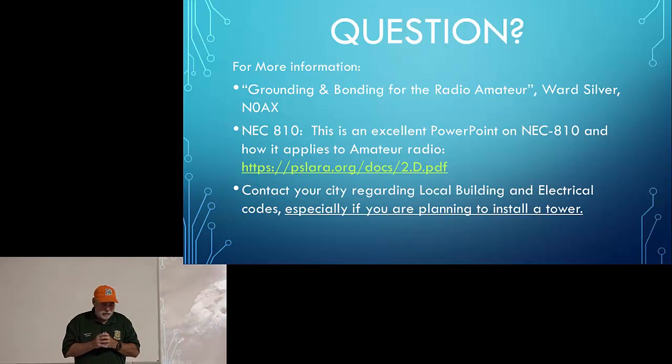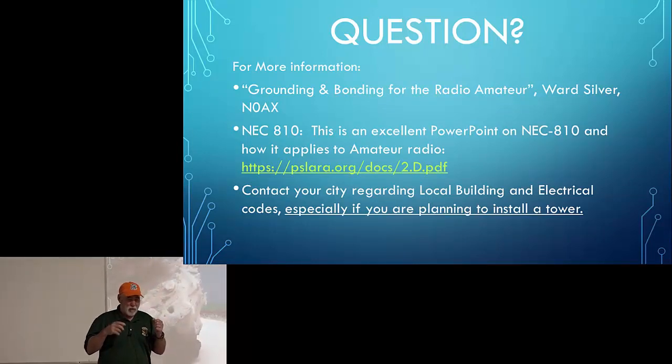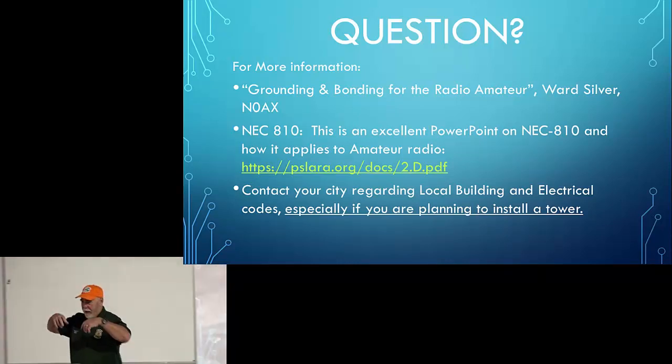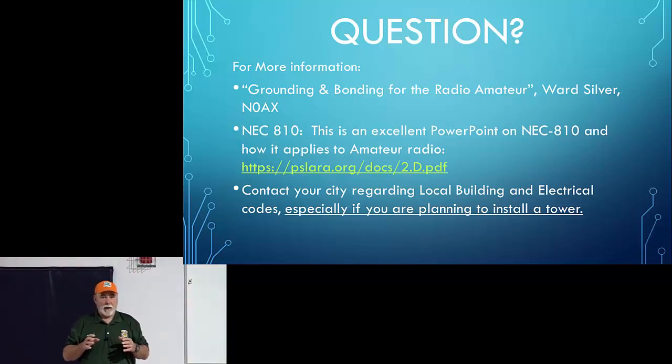So what he's referring to is this kind of common fallacy regarding SWR, that reflected power is lost energy. So if you've got an antenna with a 2-to-1 or 3-to-1 mismatch, in other words, the feed point impedance is different than what your 50 ohm coax is, that reflected energy just evaporates into nowhere. And that's not what happens.